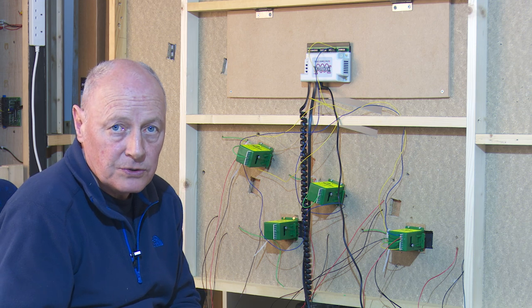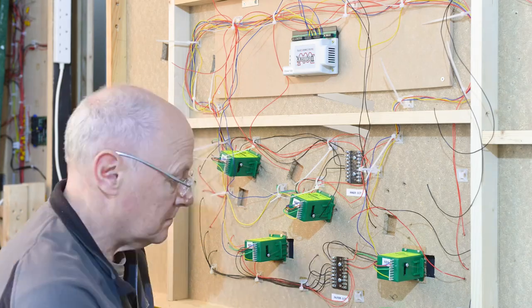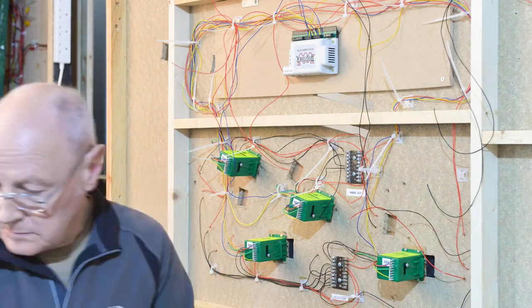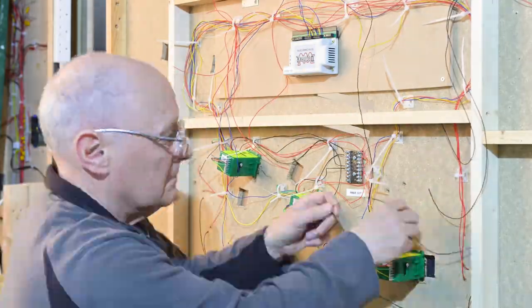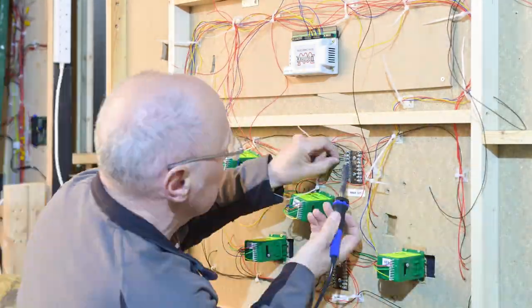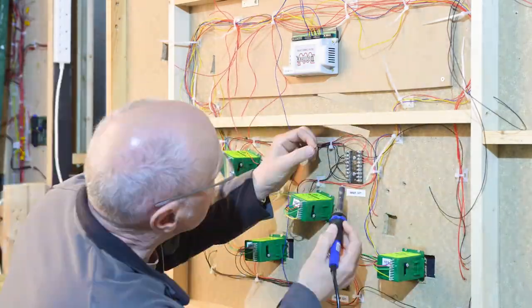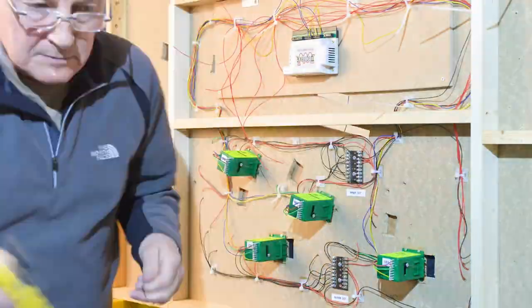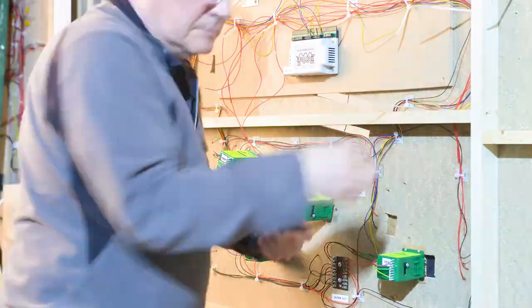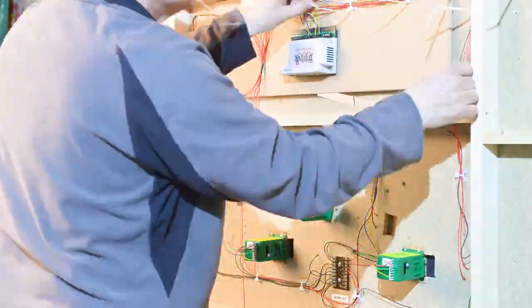Well, I progressed that yesterday, and as you can see, all the point motors are labelled. The cables are running up towards that component at the top, which is the Digitrax DS64, which is a simple point changing device. The other cables you can see added in now are the droppers. Those are the red and blacks, and you can see that there are two tag strips in place, one above the other, which I'll explain in greater detail shortly.